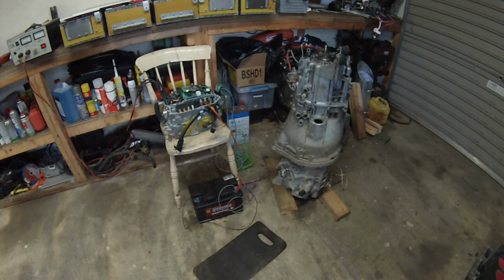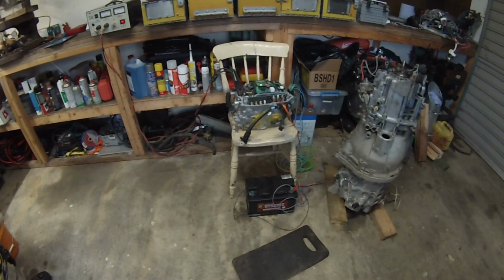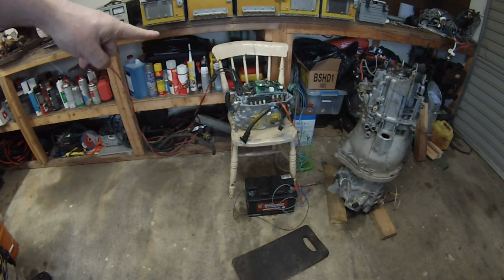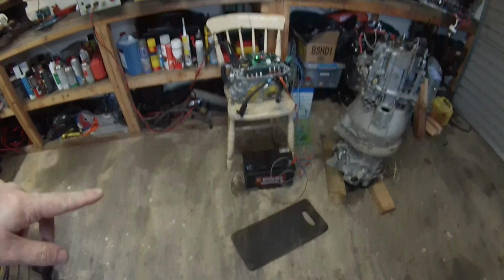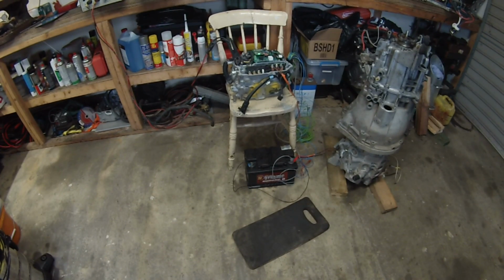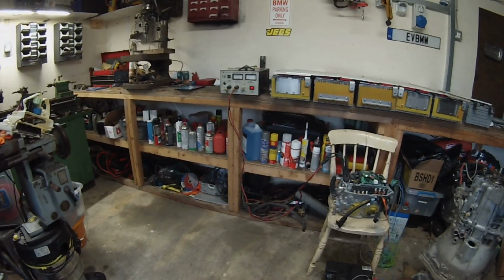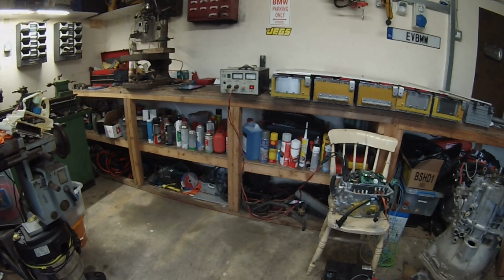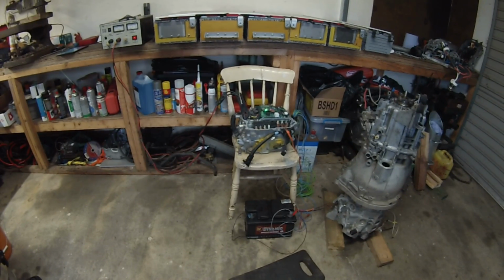Okay, so we've skipped ahead a few steps, but don't worry, we will cover them. Now, what we've got for you is our Lexus IS300H inverter, our prototype open source logic board. We just got a 12 volt car battery here supplying us with 12 volt power, and up on the bench there we got just a forklift battery charger supplying about 40 volts DC to the high voltage bus.